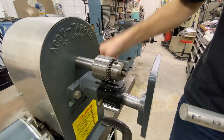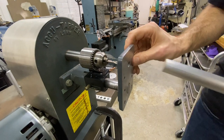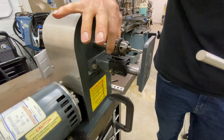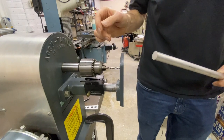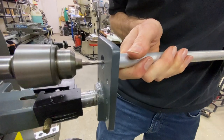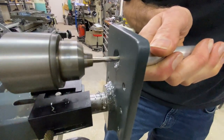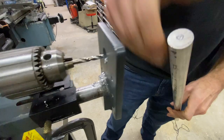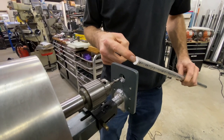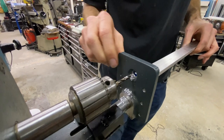You could also put drills in here if you needed to drill into something unusually long that won't fit in your machine lathe or mill — you could do it on this very quickly and easily. Turn on the switch, that turns on the motor. The motor runs all the time and the machine is activated by pressure: push against it and the chuck turns clockwise, pull away and it goes in reverse. You could center punch your hole and do drilling operations with this. Safety would depend on the size of your part — make sure it's big enough to hold on to, or clamp it in a fixture. You could then swap in a tap and do your threading and have your hole in the end of a long rod. This could also work for rectangular or square stock set up in a simple alignment fixture.